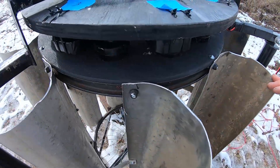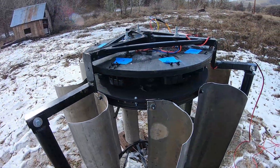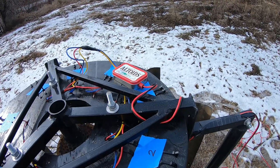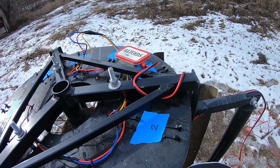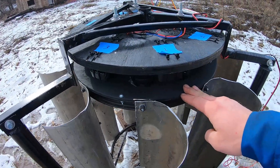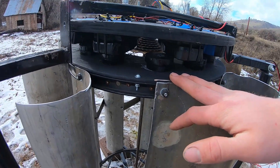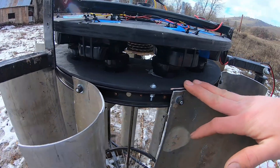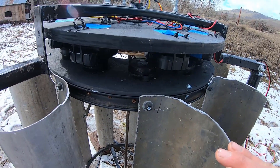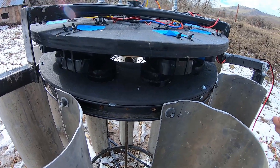This is a piece of quarter-inch plywood mounted to the top of that wheel and then bolted down. There are 12 sets of magnets, because this generator is set up to be three-phase — three-phase AC output into a homemade three-phase rectifier, which outputs a steady DC signal we can use to charge our batteries. What you need is nine coils and 12 magnets. Originally one magnet layer, but then I went with thinner plywood and did two just so I got more magnetic lines of flux. I'll go into a little bit of detail on disassembling the magnetrons and the transformers, because that's something you need to be very wary of and careful of.